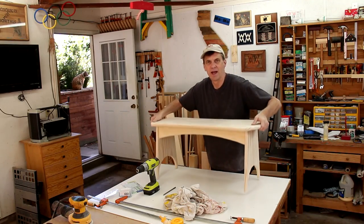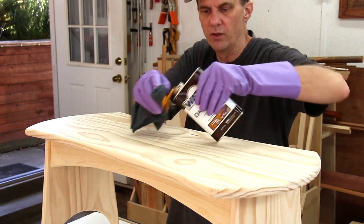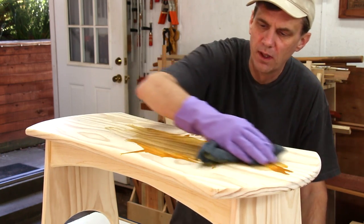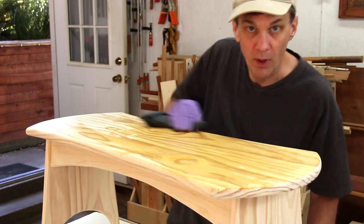Normally I would apply a few coats of lacquer or maybe paint it, but I decided to do something a little different this time — Danish oil, Golden Oak color. I used this before but never really knew what it was; I figured it was just kind of like linseed oil. But after attending the Weekend with Wood magazine conference and sitting in on a class with Mark Spagnuolo, the Wood Whisperer, I learned it's just a blend of oil and varnish. I'm flooding it on using a rag — you get the earthy look of an oil finish with the protection of a polyurethane. I put two coats on and wiped off the excess. It looks pretty good.